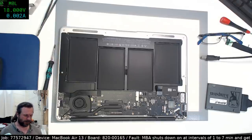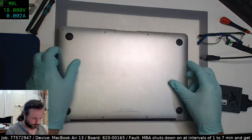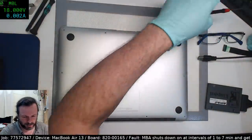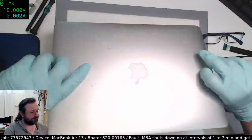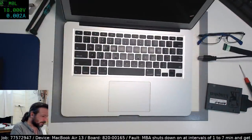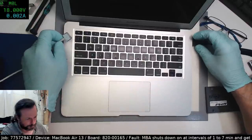Okay, well, I'd say the fact that G3 Hot takes the dive, we're definitely looking at an ISL type scenario somewhere. Let's just 100% verify it will do it on their battery, which I'm fairly sure it will. And then we'll take the board out. And at this stage, we may just do the blind replacement of the ISL and see what happens. At least because we've now put the time in to try and work it out, we actually have a better idea of what we're dealing with.